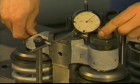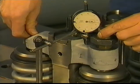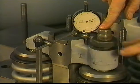Press down the opposite side of the bridge piece and turn the adjusting bolt clockwise until it touches the valve stem. Press down again the adjusting bolt side and level the clearance by means of the adjusting bolt.